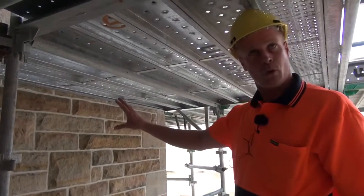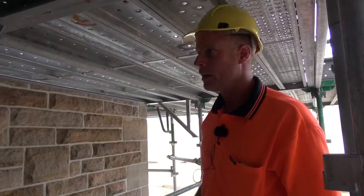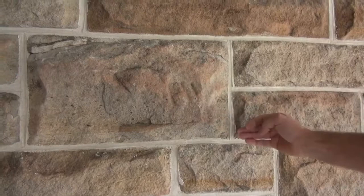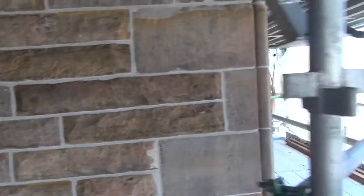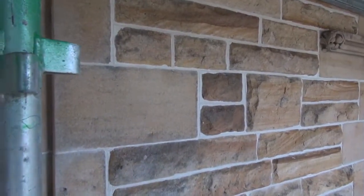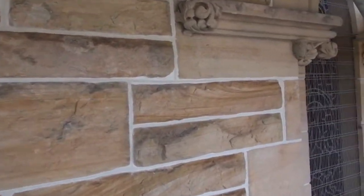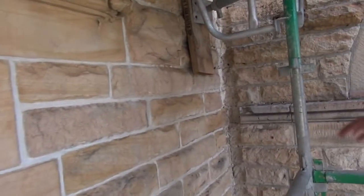This is the side of the store — this is a fully completed, depointed, repointed, cleaned wall. It shows how nice and neat and crisp the colours are. The pointing has been struck as per the original mason strike, so the joints are filled back up and then re-struck. If you come into this corner, you can see the difference with the existing mortar and the mortar that we've used.